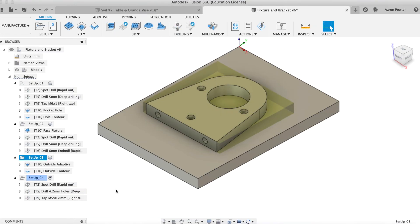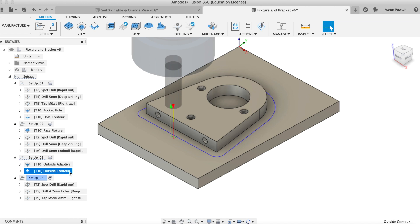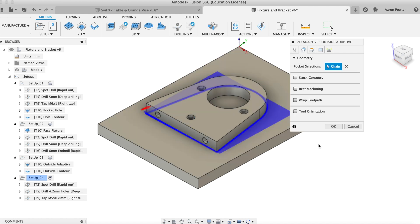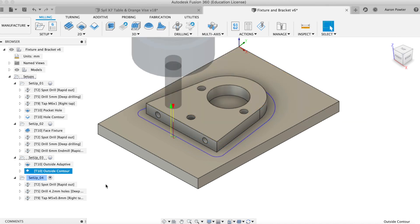Setup three includes bolting the part to the fixture plate. I've kept the same work coordinate system for both the fixture plate and the part, so all my Z movements will be positive — they won't be negative. The fixture plate will be zero. We'll do some outside adaptive clearing and then come around and do an outside contour. To make sure I get all the way through, I control that in my heights tab. This is a problem a lot of people have with their CAM — they come from a 2D background and like to pick the top line, which was common in old 2D CAM systems using DXF or vector files. However, in this 3D modeling environment we're able to select the bottom contour, and then in the heights tab I tell it to drop down minus 0.1mm from that selected contour. Let's go over to the machine and check it out.